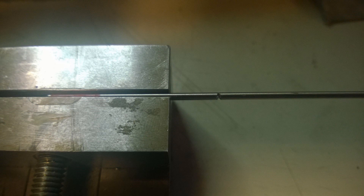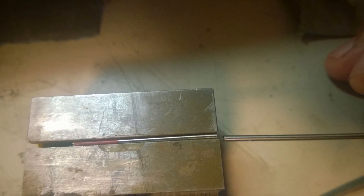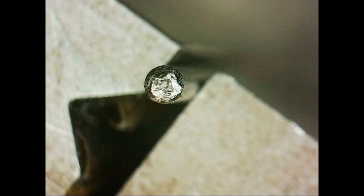The next picture is the tungsten electrode. Do not just snap tungsten by sticking it in a vice — it will actually split the tungsten. Ask any TIG welder: if you snap tungsten you will get a split right down the material, which means you'll get dodgy arcing. For spark plugs, what I did here is go around the entire electrode with my triangle file and filed a groove all the way around it, then you can snap the tip. You can see that's where it snapped in the little vice, and under the microscope you can see it's broken quite clean.